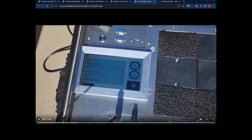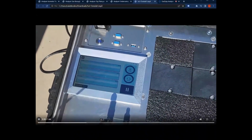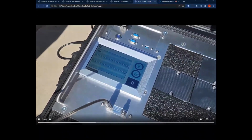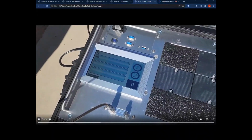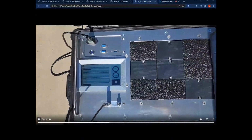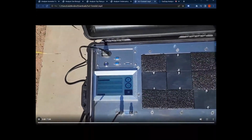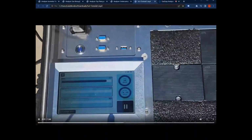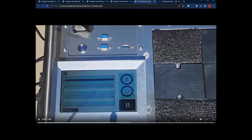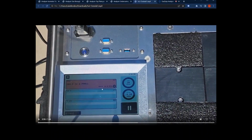So the gas that we're testing is actually high in SO2. So you'll see that the first test that runs is the SO2. And we actually have the device set to abandon the rest of the testing if the SO2 sensor reads a high level of SO2, or past the threshold that was set by the user. We just do this to protect the rest of the sensors from the destructive nature of the SO2 itself. So you'll see here in a sec that we have the SO2 threshold set arbitrarily to, I think it was, 10 ppmv. So you'll see that down here.